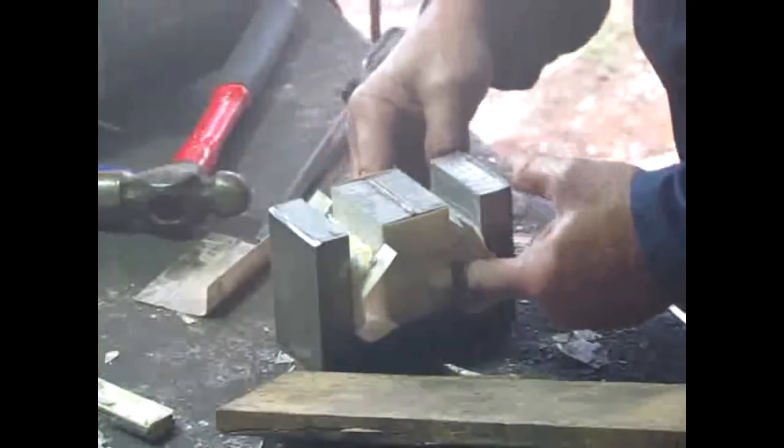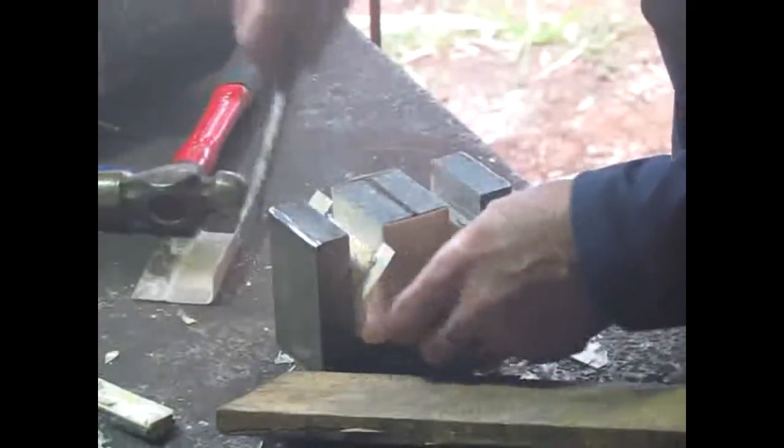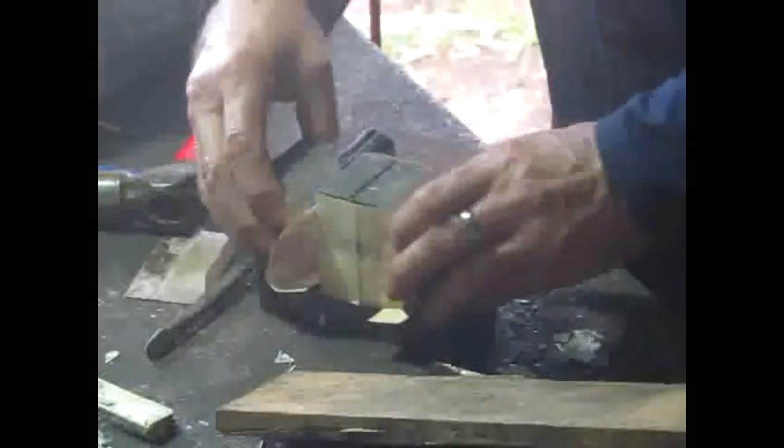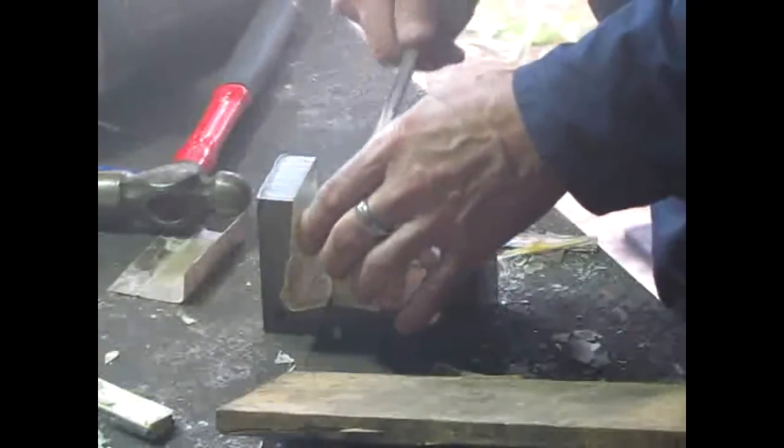That's the second one done. I don't know where this wire came from, but we don't need this, but a lot of people just cut these off when they're making these spot transformers. A lot of the insulation's been destroyed, but we don't need it that much. There's nothing there to insulate it once we put the primary coil back in.